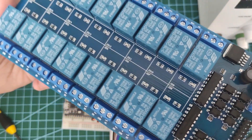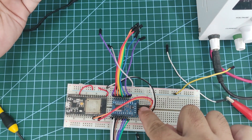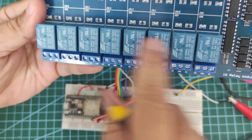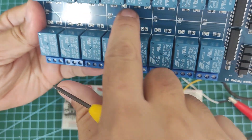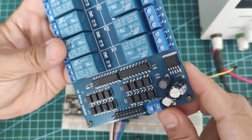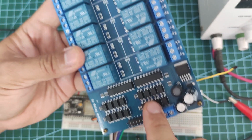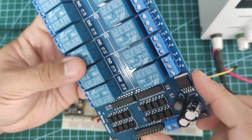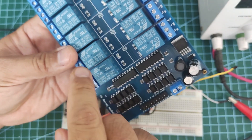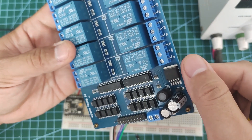I'm going to show you how we can control our 16-channel relay with the ESP32 and the PCF8575 port expander. I have here my 16-channel relay — there are 8 relays on each side. It contains an LED for each channel so that you can see if the relay is triggered. It also contains an optocoupler for each side so that the input from the ESP32 is isolated from the output that we are controlling. It also contains a Darlington Array Transistor IC that controls each of the individual relays, and an LM2596 regulator so that the voltage is properly handled.